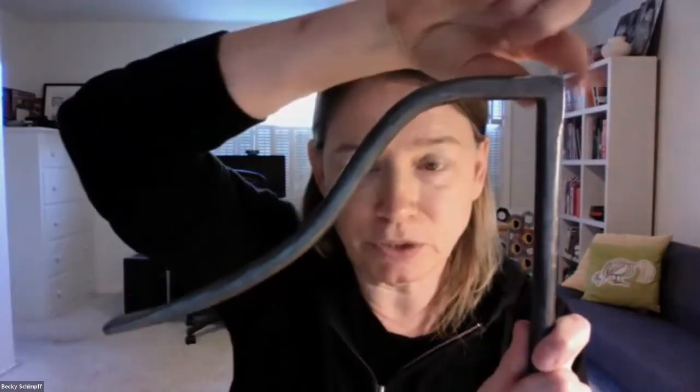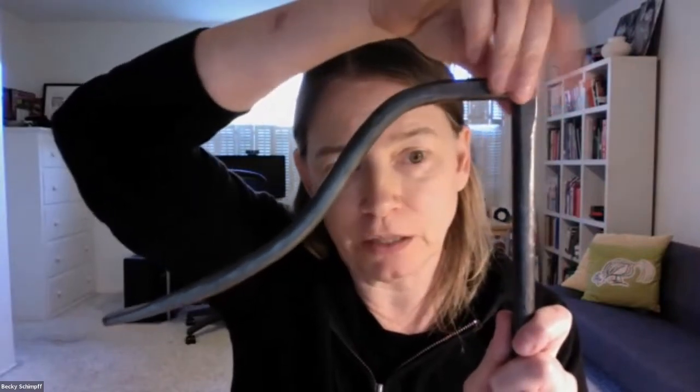And the answer. I'll have to be honest, I have not forged a square on a round where it maintains the round. I have seen that done. What I have done is, for example, making a hold fast, to give it some extra strength, you can use round bar and put a square corner right there. And that gives that extra strength on that hold fast. What you're talking about is rounding this part, and I've seen it, but I haven't personally done it. Okay, yeah, I was just curious to see. I assume you would swage with a rounded swage on the corner and then hammer the swage.